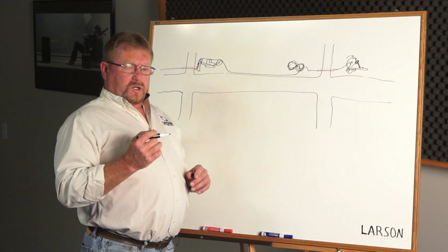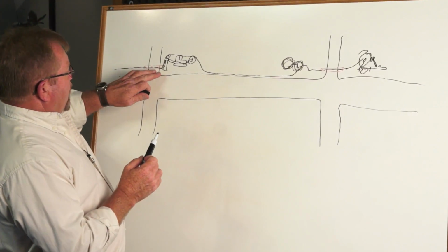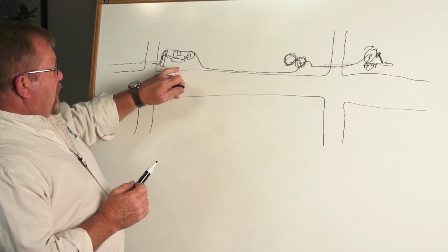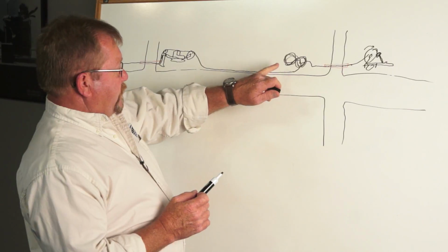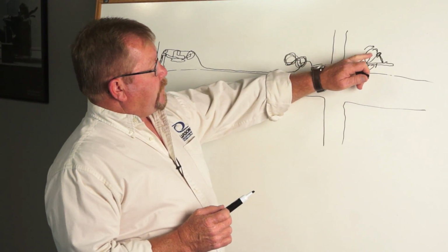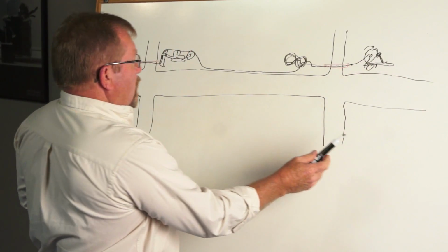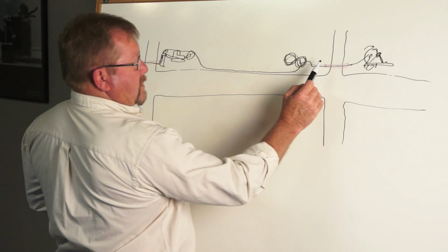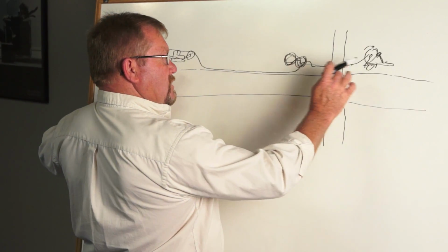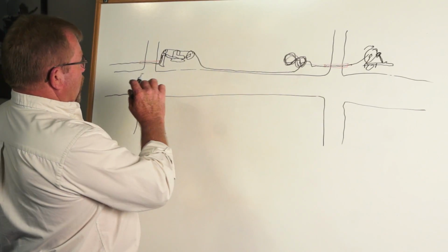In a direct bury situation, what we found by separating the 2 that I referred to earlier is when we've got a direct bury situation, we have a road bore here. We've buried the cable already in the ground. We've got our cable plow here. We've laid the cable on the ground in front of it. We figure eighted here on this side of this bore, and we're rolling it back up on this side, getting this all through and back on the trailer and getting ready to go again before this cable plow gets up here and gets delayed during this process. We time it so we can stay just far enough ahead of the cable plow to where we keep the cable safe and we keep the plow going.